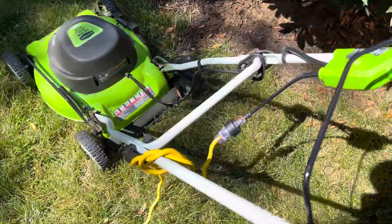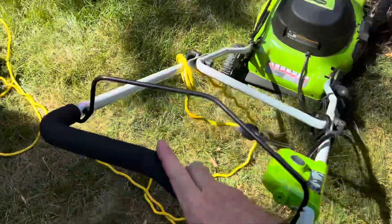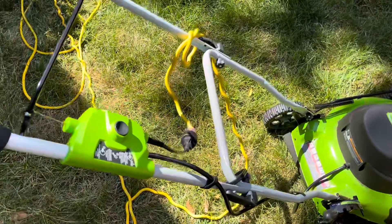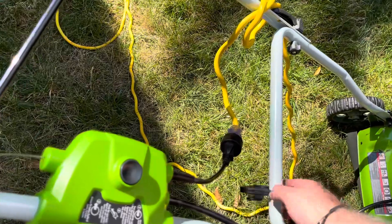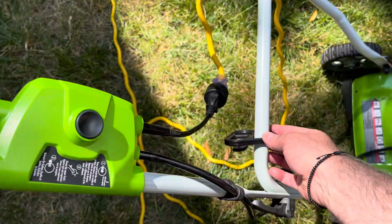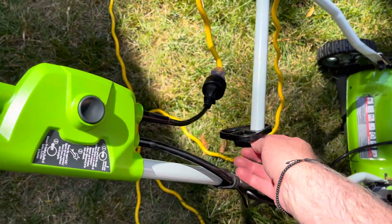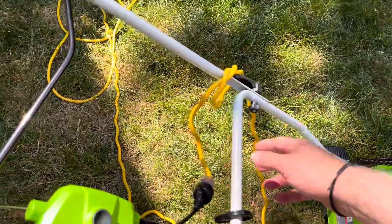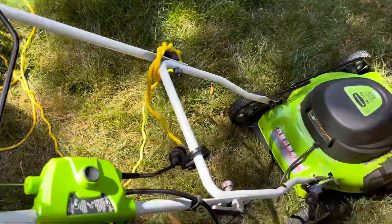As you can see here, I'm using some very thick cable, and the reason for that is I don't want the voltage drop to harm the motor. Longer runs, thicker cable. This is 12 gauge, so it will fit on this cable management piece — you just put the cable in there and attach it. I just chose to tie it in a knot, and then I just bring it up higher so I can hold on to it to keep it out of my way.